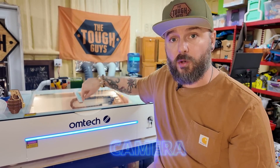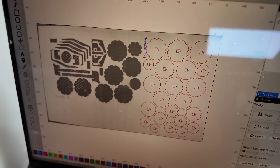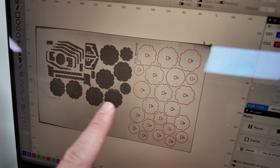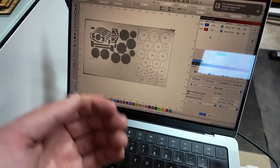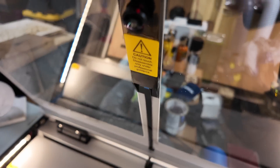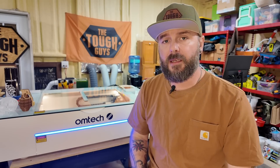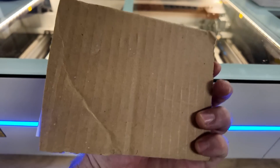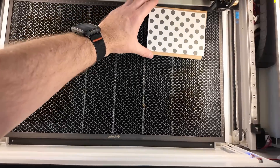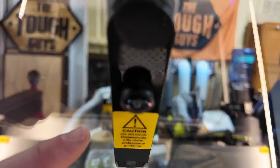Another great feature is that it has a camera built into the lid. So if you're using Lightburn, for example, you can do an overlay onto your grid so you can see what you have inside the laser. It definitely helps you when trying to place something exactly where you need it to be. The process to set up the camera is a little bit difficult, but there are a lot of videos online — I'll try to link a couple in the description. Basically, you have this little punch card with some dots on it, you set that down inside the laser bed and move it around, and that process maps the grid correctly so it can do the overlay inside the software.